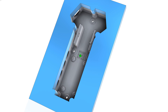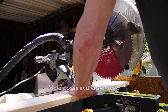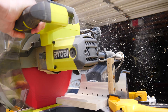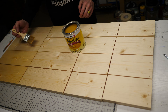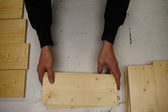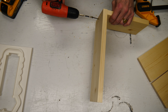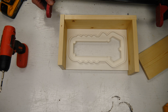The blue here is the splitter boards and we print those in one piece to help us make the molds. We need to make 60 sets of these cases and two sets of each of the molds. To do that, we're going to use some three-quarter inch pine to make the mold boxes. You can see the 3D-printed splitter boards, and we build the box around those so it fits and seals nice and tight.